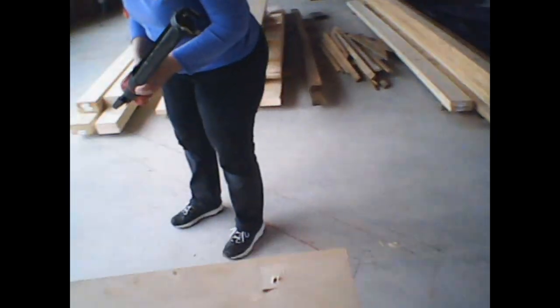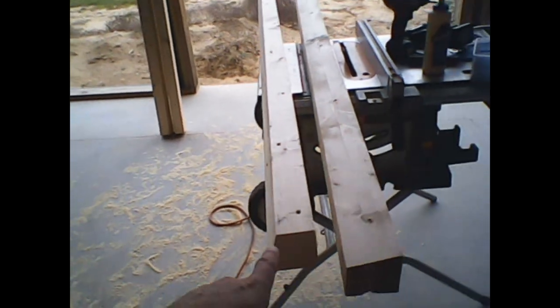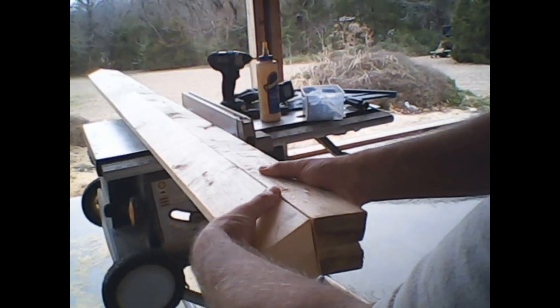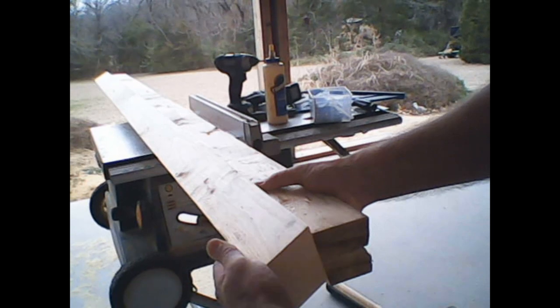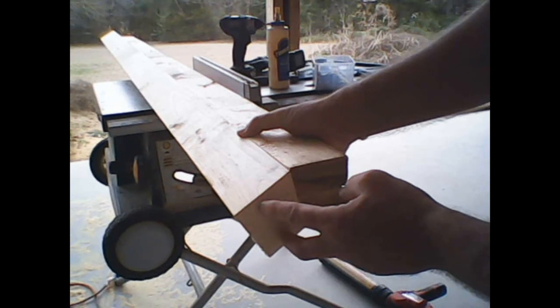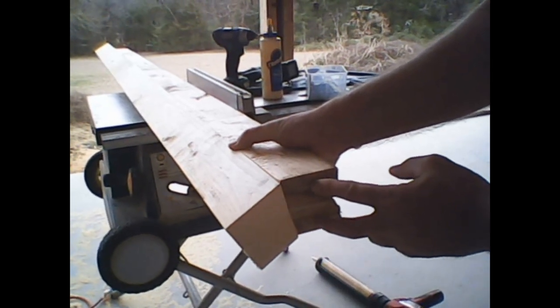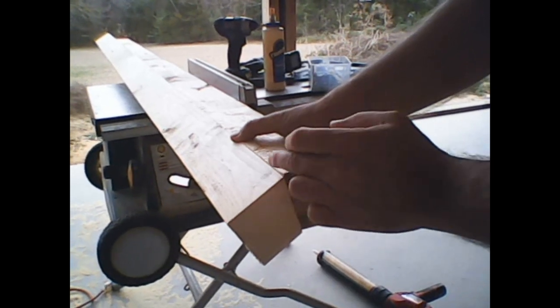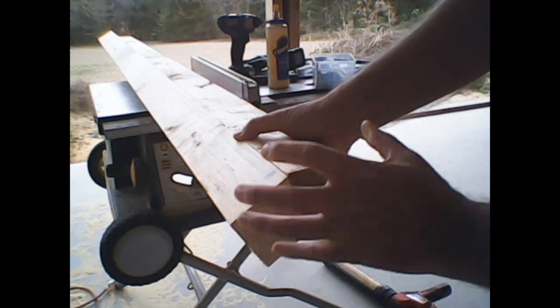And then because these are on the corners of the house, basically where the hip and the valley is, we actually need two of those. So here are two of those that are already assembled. And you see how they're cut at a 15 degree angle. And we set those together. That is our 30 degree angle between, for example, the center section of the house and the right section of the house. Now we can just glue and screw these together, and we have one big solid ridge pole.